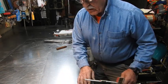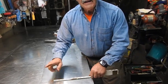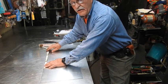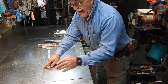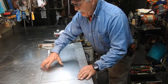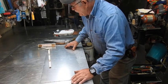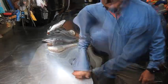Then we'll pick a point up here off of the base, probably about 8 or 9, maybe 10 inches in, to put a mark. And we'll measure back from the tip of the piece of duct a comfortable dimension, which is going to be roughly around 13 inches, and make a mark. Then we'll tie that 10 inch dimension to the 13 inch — that's going to give our angle for that somewhat squared off radius so that airflow goes right into the side of that trunk line.